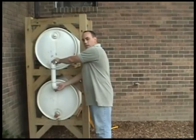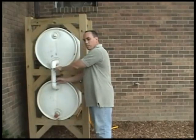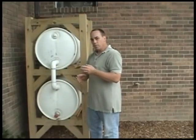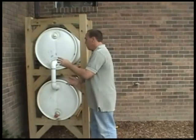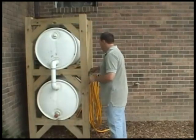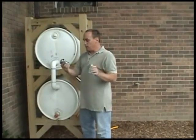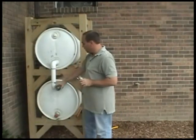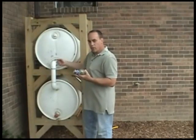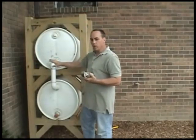For the elbows — the 90-degree elbows and the two-inch PVC pipe — do those separately. Take the whole unit, build it first, measure it out, and then put them together and just slide it right on. Before you do all that, you do have to use plumber's PVC cement and also the purple primer. Use the primer, wrap it around, then use the glue, wrap it around, put everything on and it will set within 30 seconds.